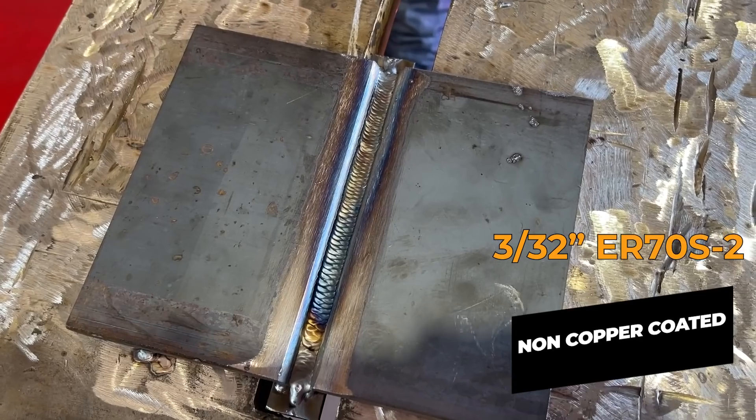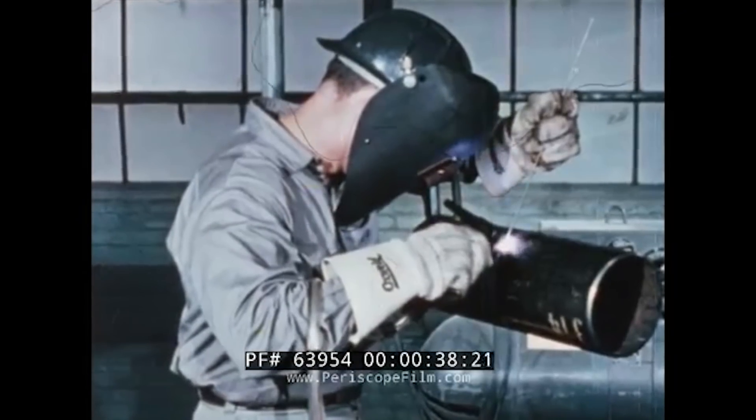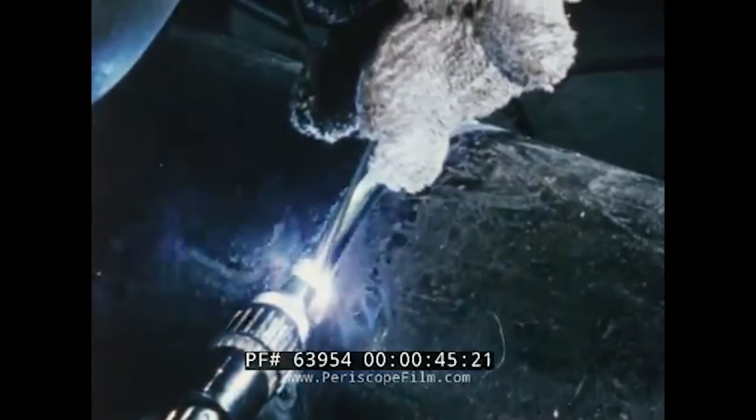There's a lot of things out there right now — a lot of welders are saying they have to have specific wires to be successful, and we're here to basically prove it wrong or prove it right. The 70s2 wire was originally designed to have triple deoxidizers in it, enhanced with titanium, zirconium, and aluminum, which increases the weld stability of the puddle on dirty or rusty steels.